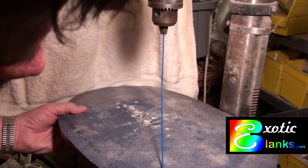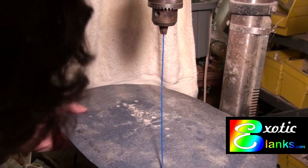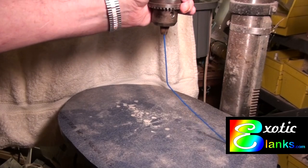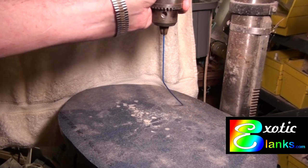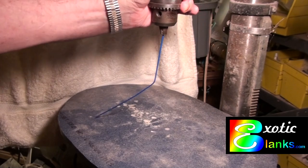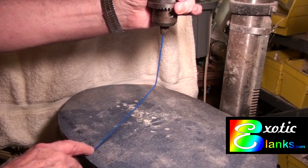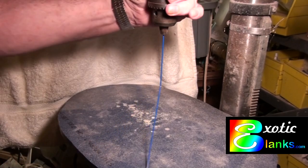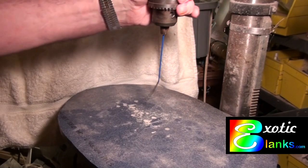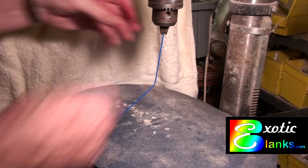With mine, I have an adjustment method that's hit it with your fist. There's probably a better, more scientific method of doing it, but that works for me. That way I got it to where you can see it is touching all the way around on the table. So at this point we know that the table is perpendicular to the drill head, and that's what we were trying to achieve.